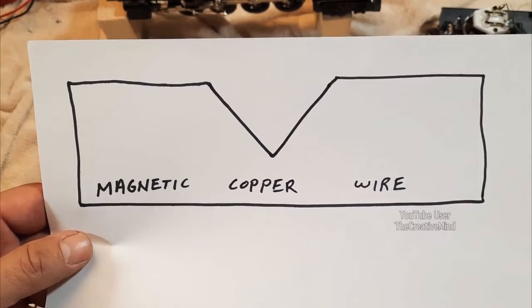When testing this wire gauge, it's best to take a pair of needle nose pliers and try to straighten out the wire as best you can before putting it into the slots, or else you might get the wrong size wire for this motor. Putting it through again — it's definitely 24 gauge wire. To find out how much wire we need, we start unwinding and counting at the corner as our reference area. We count as we unravel — 148, 149, 150, 151 wraps — and I measured out a total of 28 feet of 24 gauge magnetic wire.